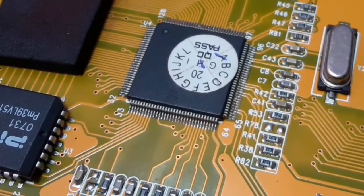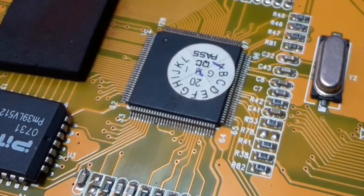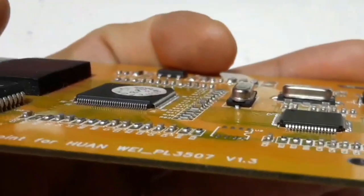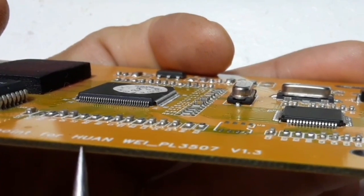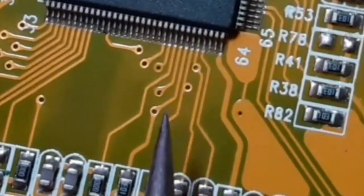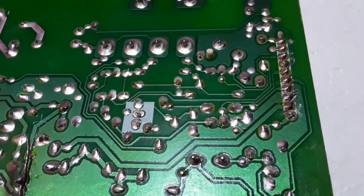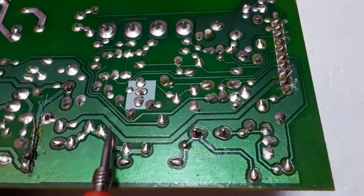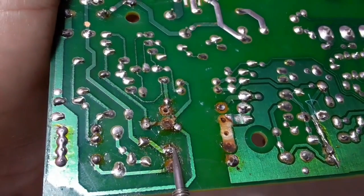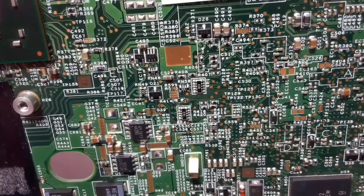Always use extensions instead of taking measurements directly into IC pinout pins. These holes in the board mean this is a multi-layer board — there are multiple layers integrated with each other. It can be three, four, five layers or more; that's why you find these holes. Let's look at another motherboard — the large path is always for ground, and a bolded line can hold very high power.